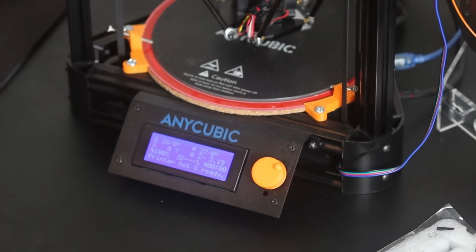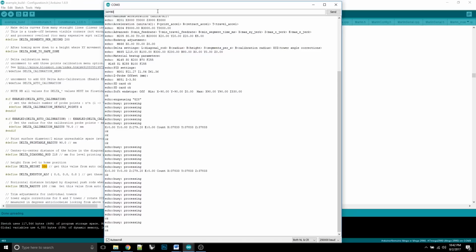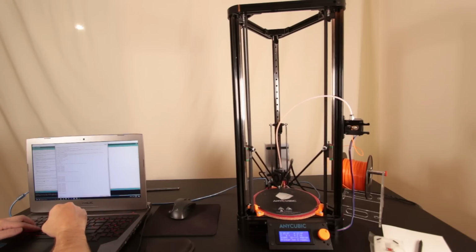Let's go back to the computer because I find this easier to do. So let's go G0, Z10. And remember, we're at negative 3.1. Here we are, right there. G0, Z10. Okay, now we know we're not going to have a collision. Now we're going to type G0, Y80, and you'll see that the printer is going to move to that far edge right there at the pillar.